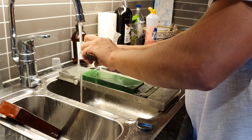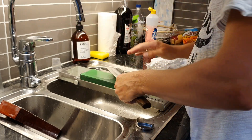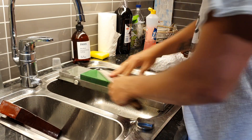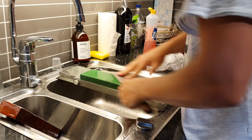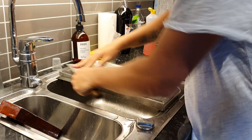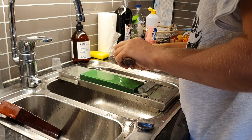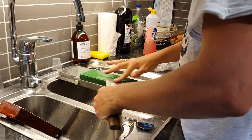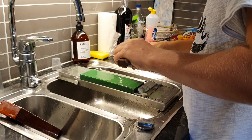You can see it actually taking off a little from the stone. I'm watching the edge and the scratch pattern changes — you can't see that on camera, but it's going from hazy to a little more refined, and I'm moving that refined pattern closer and closer to the edge. I'm not over-polishing; I just want it to look somewhat okay. Now going behind the edge on the other side.